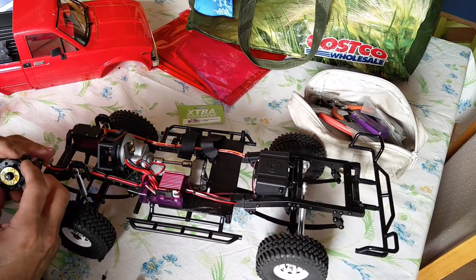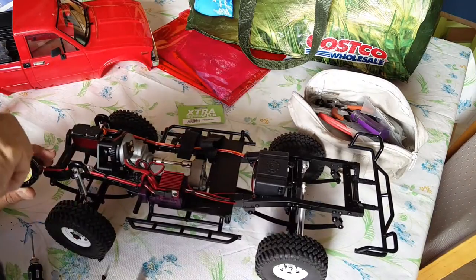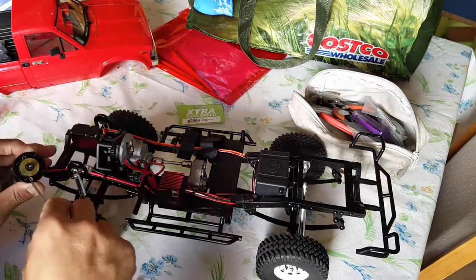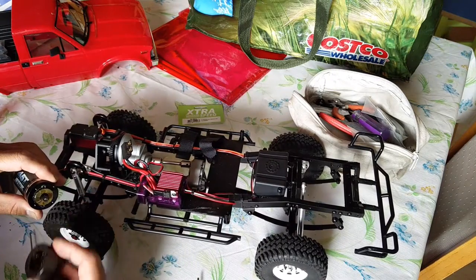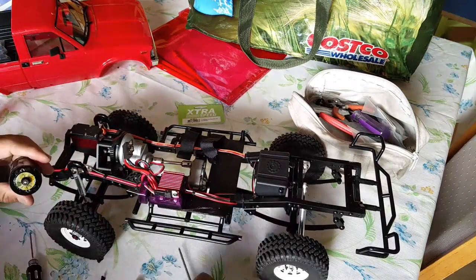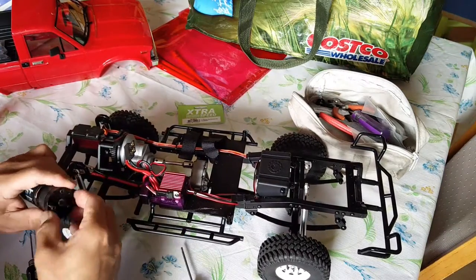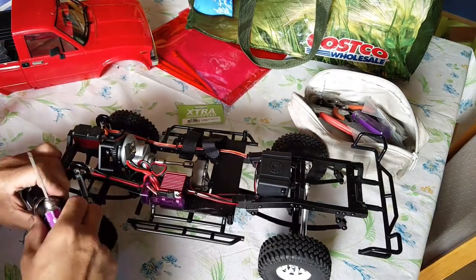With the motor out, I've installed the mounting plate from the reduction unit onto the motor with the pinion in place, because the set screw for the pinion is gonna sit inside that mounting plate. Then the gear reduction unit goes over that and you tighten the screws down.